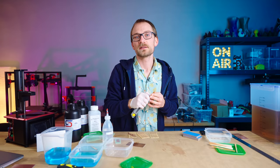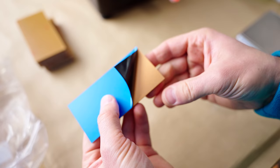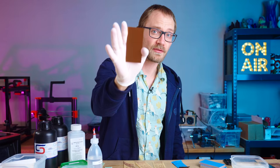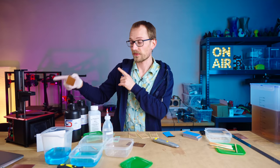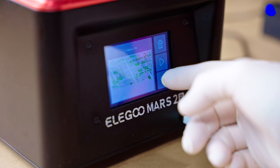The standard way of making PCBs — printed circuit boards — is by using photosensitive coated stock material like this. It's a pretty simple buildup: you've got your carrier material on the bottom, this is glass fiber or in this case paper, typically. Then you've got a full sheet of copper, and with the photosensitive ones you also get a thin coating that reacts to UV light. This thing also uses UV light to cure layers — see how this is coming together?